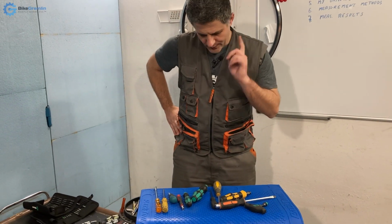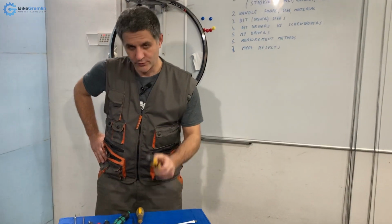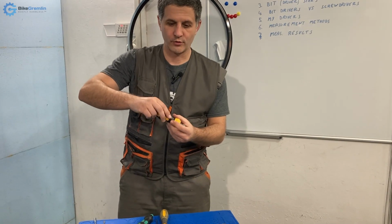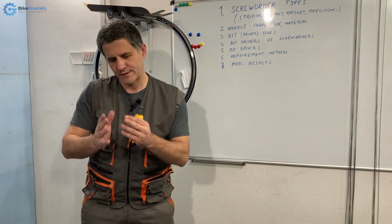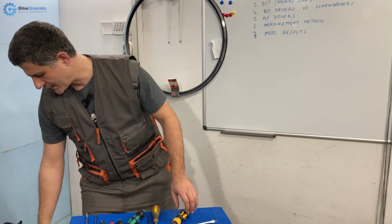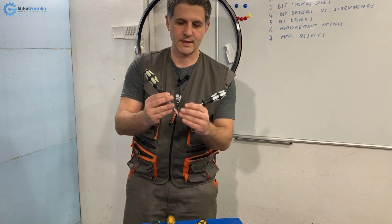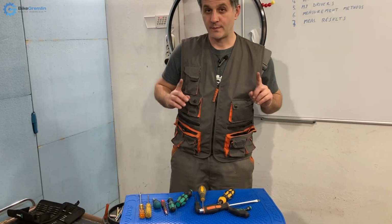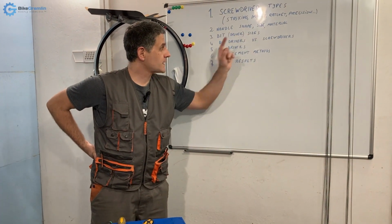And another thing, I think I've covered it now. You can have a screwdriver that is too big. When it's too big and bulky, you work too slowly for smaller torques. So it's best when it suits the bolt size and the required torque that you are likely to be using. That's why when you buy separate screwdrivers, they usually have a handle that matches the size of the tip. So I hope I've explained that clearly. And now let's go on about bit driver sizes.